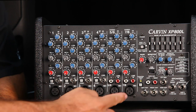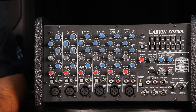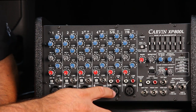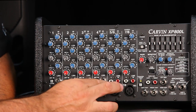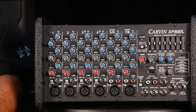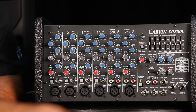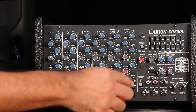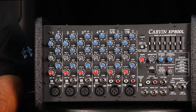You can see right off the bat there are six XLR microphone inputs. The last two channels are actually stereo channels — channels 5 and 6, and 7 and 8 — which also include a pair of stereo RCA inputs so you can connect stereo sources such as a keyboard, sampler, or any other stereo audio device. And because these channels have both XLR and RCA inputs, you've effectively doubled up the use on those last four channels.